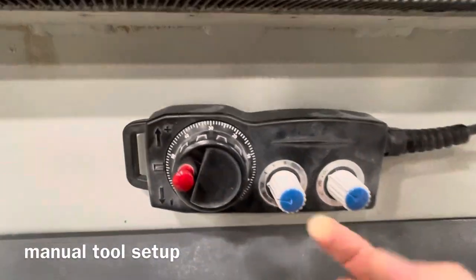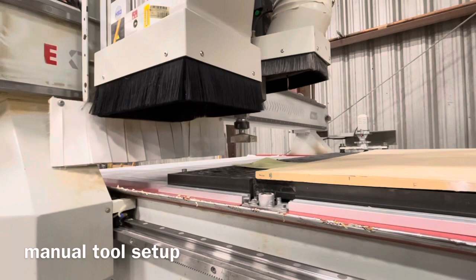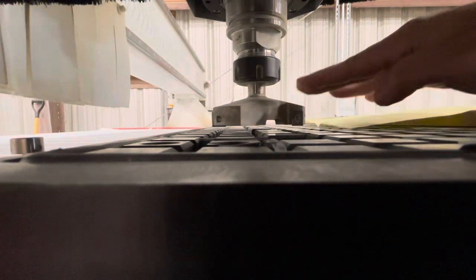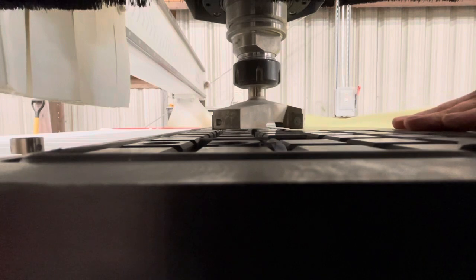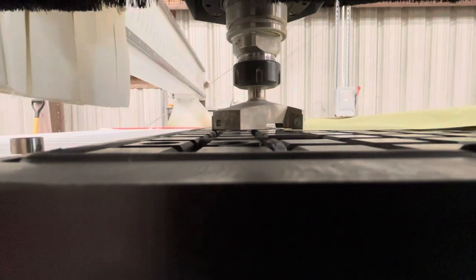Make sure that's on Z, and right now it's on a thousand or a hundred, so this will go pretty fast. I can just turn the wheel and dial that down. When I get close, I can change to medium speed. I'm going to put that wing right over a black square. As soon as I get resistance where I can't move the paper anymore, I know that I'm good and I'm sitting on top of that.